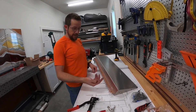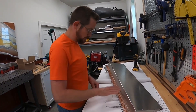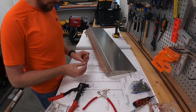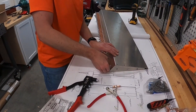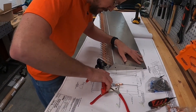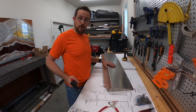I went ahead and deburred the inside and outside edges of the hinge, the inside and outside edges of the rudder, and the edge along the seams. Everything fits together just perfectly. Now the only thing left is to put all these rivets in. Using the CLECO tool to remove each one, you take your CCP-42 rivet — it should fit fairly snugly in the hole — and just make sure it's nice and straight as you're squeezing. There's one, and we'll just do that about 36 more times.